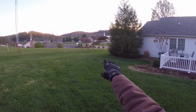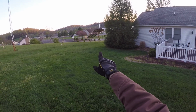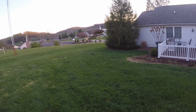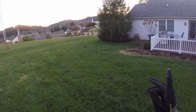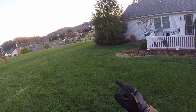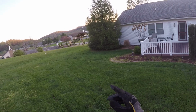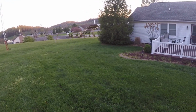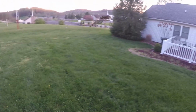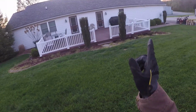And you can see there is my solar, and I have 2 tracking, two not tracking, and that's the wooden setup that I made first just to figure out how all this stuff works. I started out with 4 100 watt panels, and then I switched to these, which are 270 watt panels, and the cost on them was approximately $1,200. So really, if you think about it, not bad. Probably about $1 a watt is what everything's going for. So those are going to be all 4 on the new tracker.